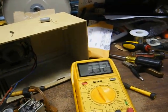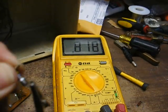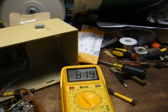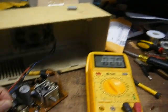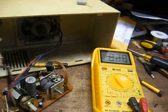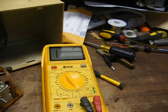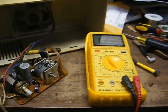This is a 2.2K-ohm resistor reading 3.3K, so as you can tell that one went up. Here's a 470-ohm that went up to 818 ohms, so we went ahead and replaced that. Some of the rest I checked on the board are up a little bit, but I'm not going to bother replacing them. The radio works fairly well as it is. I also had to adjust the trimmer on the tuning condenser — it was backed way out. Usually somebody gets a hold of them with a golden screwdriver and tightens them down. I also replaced a 100-microfarad capacitor — the old one looked a little bit puffy on the end.